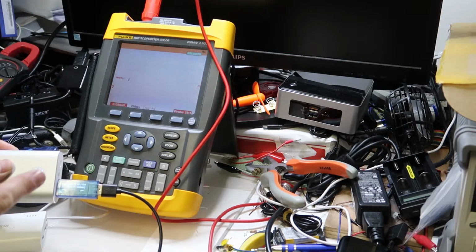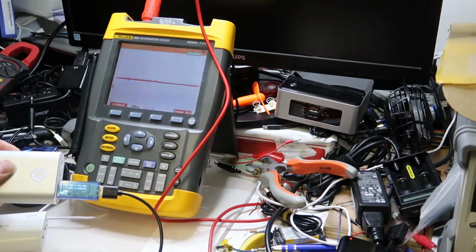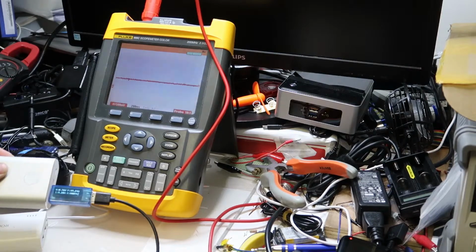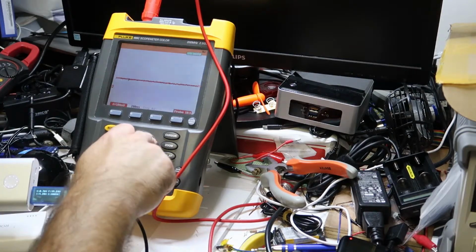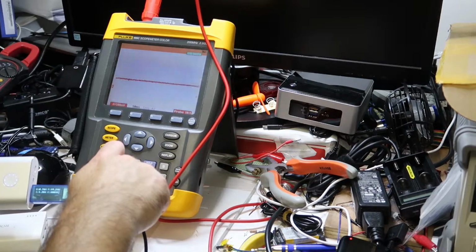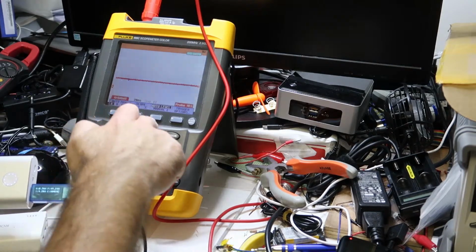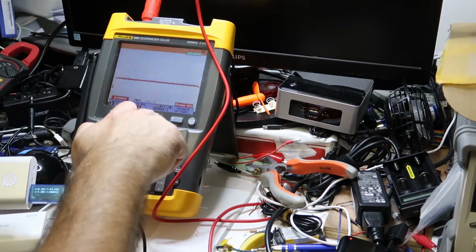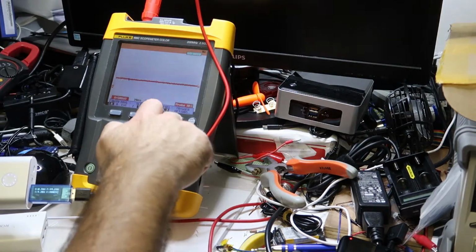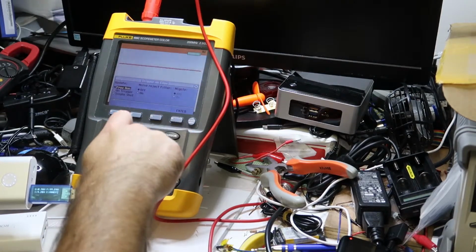And now I will try to do a voltage change from the power bank with Arduino code. So now let's look a little better at the feedback, meaning at the timing, and see if this is correct. This is the most interesting part. Okay, so let's move the timing in order to see the pulses that we are getting back. So I will move the trigger slope to the high voltages that we see and we put it on manual. Trigger option, not automatic, we want it on edge, and we'll do enter on trigger.